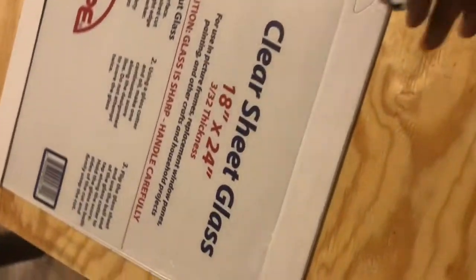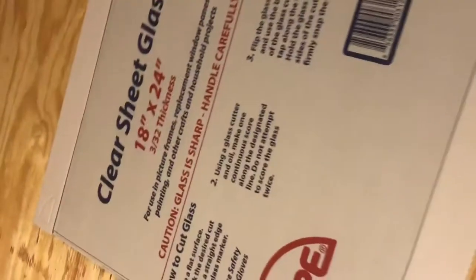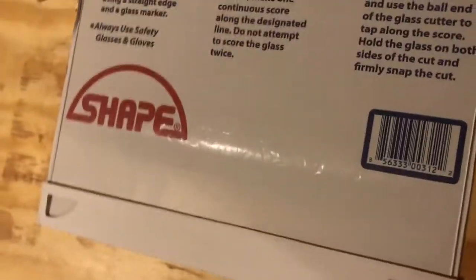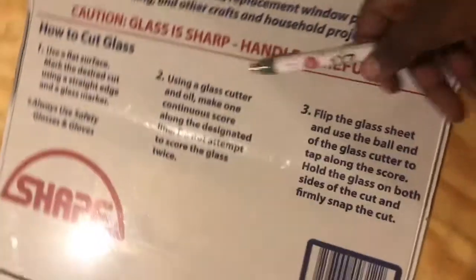What we about to do right now, we're about to frame everything out. But first, we're going to have to trace around this glass so I can sit the glass directly in the middle. Because I did a lot of research and asked a couple people I knew about wood and heat. Everybody pretty much said the same thing — wood can handle a lot of heat, up to like 300 and some degrees, maybe even less on some occasions if it's thin enough. But I ain't trying to run into any of those problems. So what I'm going to do, I'm going to put this glass into the plywood itself, and I'll have the heat pad directly on the glass.